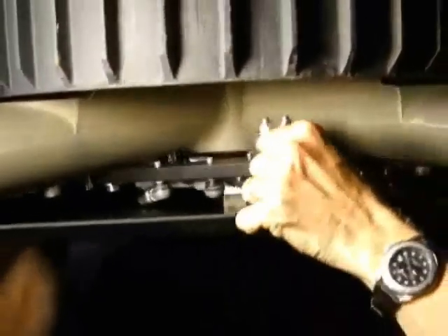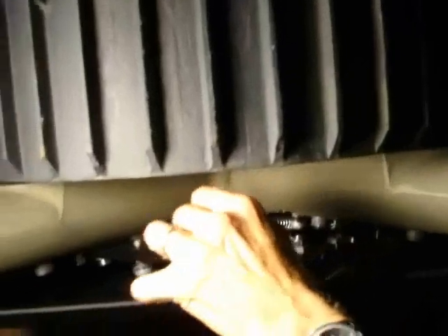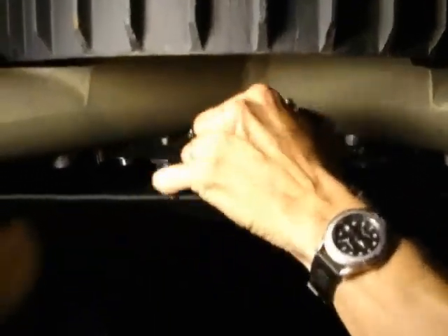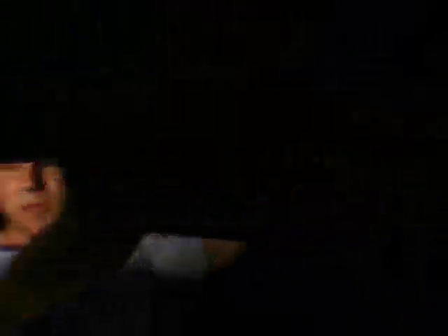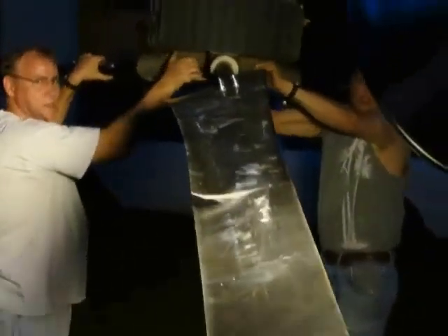We're on scene with the housing on. I'm demonstrating the governing mechanism by pulling out the counterweights, showing the clearances. Now go down by the blade tip — when we govern it, you can see that all three of the blades are doing the same thing at the same time equally. They're going to have to take our word for that. We're ready to raise this — we're going back up, folks.